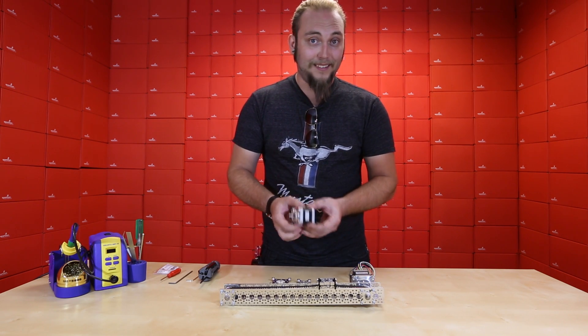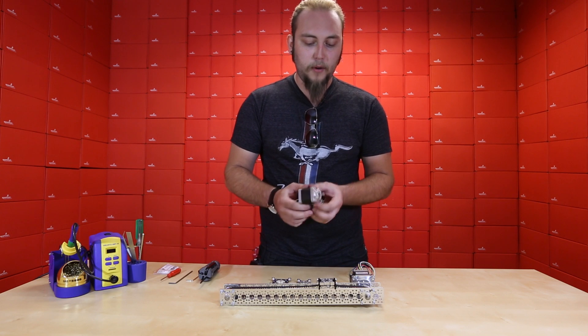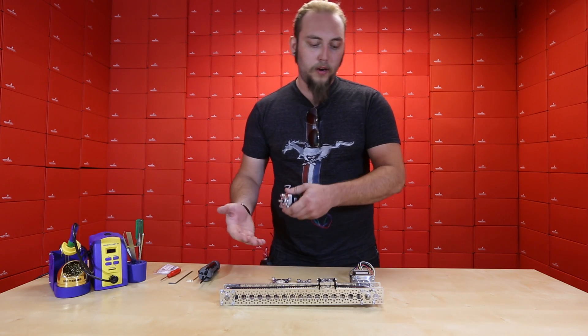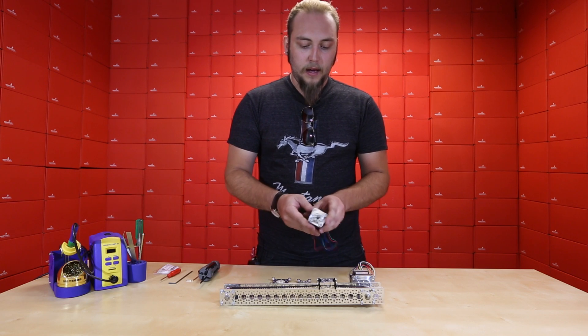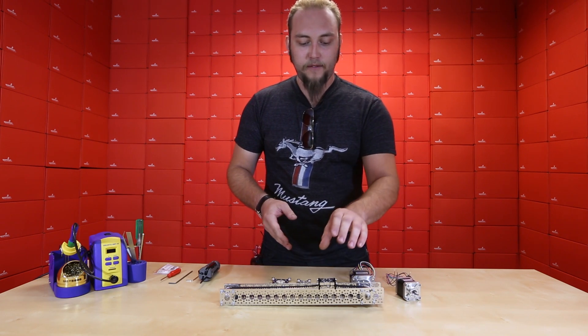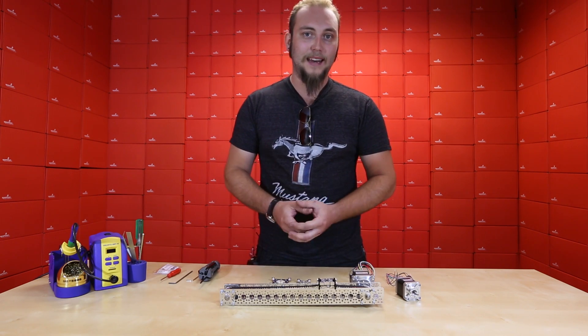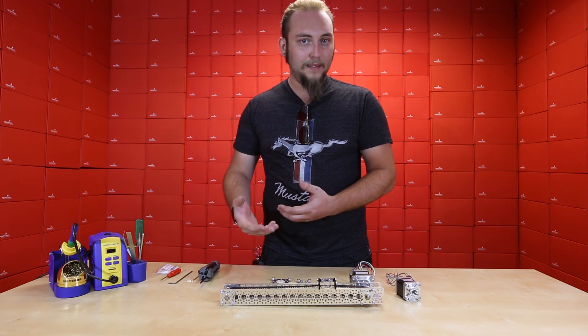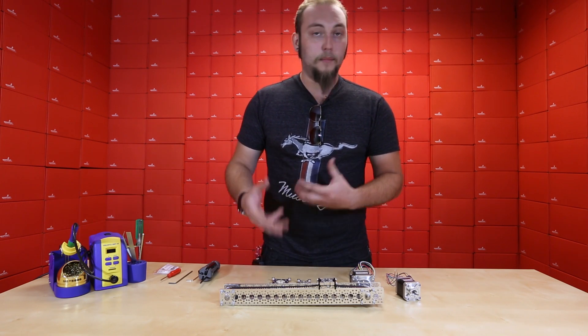In this case, the motor that you want is a stepper motor. The nice thing about a stepper motor is that it moves in tiny steps that you can record and repeat reliably, so that you have the slider moving to the same position every time. This comes in handy when you want to do something like draw, print, or automate some assembly process.